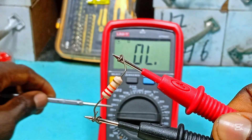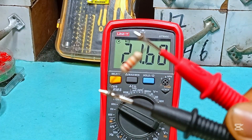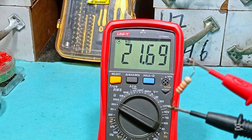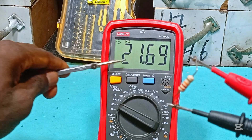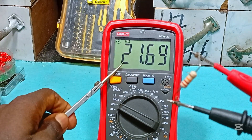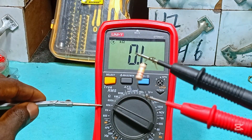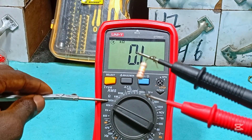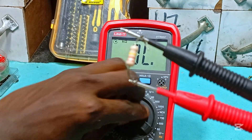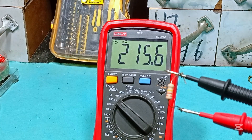This other resistor's value is greater than 10k, so we set the knob to a value greater than 10k and we get 21.68 kilohms — but it is a 22 kilohm resistor. It's still close to that value, which is okay, since it has just lost 0.26% of its resistance. For the next resistor, its value is greater than 100k, so we set the knob to a value greater than 100k, and it reads 215.6k instead of 220k ohms. Remember, tolerance applies always.